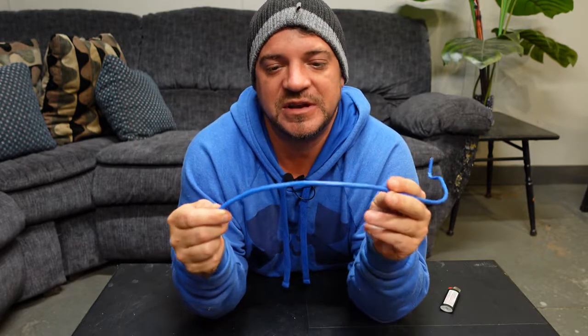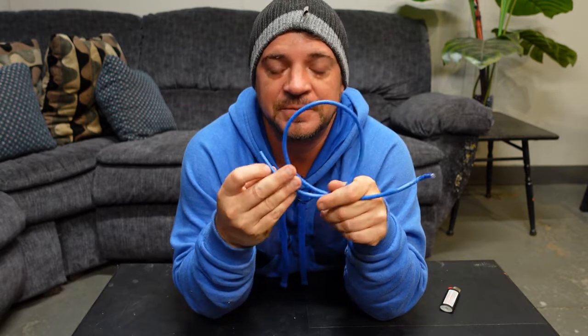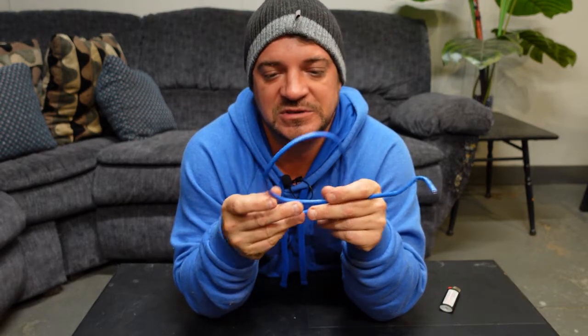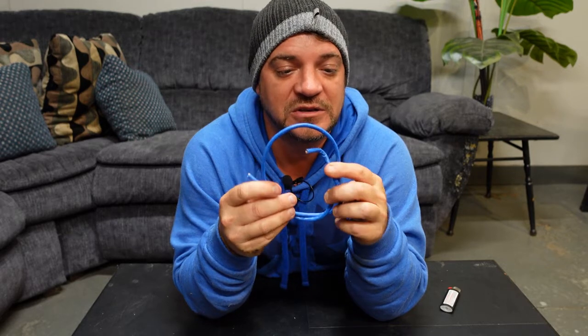Here's a piece of blue wire — up here in Canada this is Cat6. It comes in a variety of colors, is rated for low voltage, and is used basically for computer cables. Cat5 is now becoming a thing of the past; Cat6 is a bit faster and it's all in how it's coiled inside the wire. We use it for high-speed internet, basic telephone, and even doorbell wiring. It's rated for 300 volts.